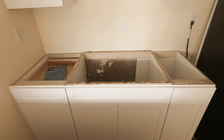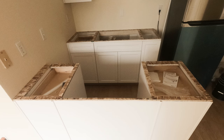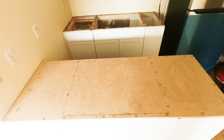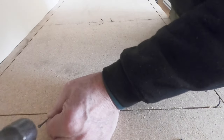I ran back to the shop and got some scraps of OSB. I ripped one-inch strips for the fronts and backs of the cutouts, and then cut the rest of the strips at about two inches or so. I tacked them into place with an 18-gauge finish nailer with 1 and a quarter inch nails. If I'm just nailing three quarter inch directly to the cabinets, I use inch and a half 16-gauge nails. But since I've blocked it up a half inch, I'm going to use two inch 16-gauge nails. I usually space the nails about six to eight inches. If you're concerned about creating excessive dust in the kitchen, you can make the straight cuts for your sink out at your cut station and cut the corners out in place. The countertop is relatively sturdy before the corners are cut and can be carried a short distance.